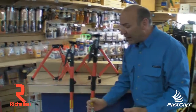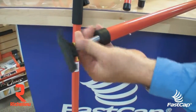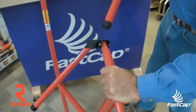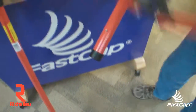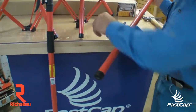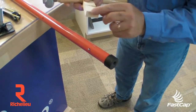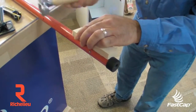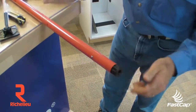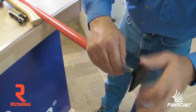When you take your third hand out of the box, you'll notice that our original or typical collar on the bottom for the micro adjust actually has a collar going on the outside of the red pole. The problem is that will not work in the tripod system, so in every tripod that we sell, we include a new micro adjust insert. All we have to do is knock this off and put in the new one. Just take a piece of wood that has a pretty sharp edge on there, take it and tap with your hammer just like that, and that will come right off the end. Then take the new one, put it in there like that, tap it back on, thread your insert back in, and you're done.